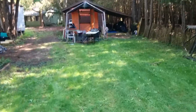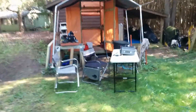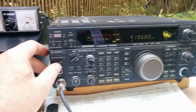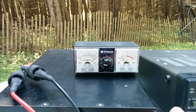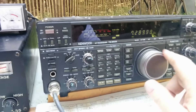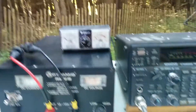As luck would have it, we're pretty well bang on with the 40-meter dipole. The 80-meter dipole was already made, so we had the 40-meter to build. First time around it tested fine - designed around 7200. After an auto-tune, we're about 1.5:1, which is pretty good. We can go all the way up to the top end of the band and still be under 2:1, which is certainly fine. After another auto-tune, we're just under 2:1 - pretty well acceptable.